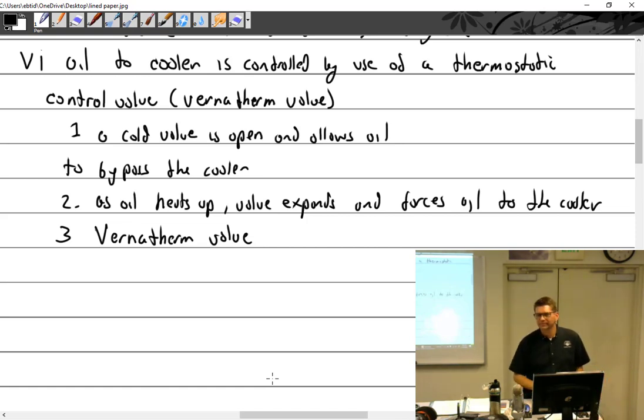Here's my second follow-up to that. Do you lose your electrical then if you have the electrical bulb? No. Neither one of them uses battery power. Oh, okay. So the first one, the thermocouple, is its own electrical source and voltmeter. Dissimilar metal causes a microvoltage, that microvoltage flows through the meter, and the meter is reading voltage calibrated to show temperature. And with the temperature bulb type, the air expands in there, and that expanding air causes a pressure change on a gauge that's reading pressure calibrated to show temperature.